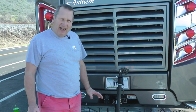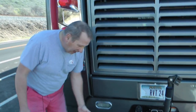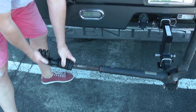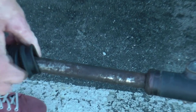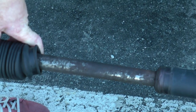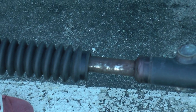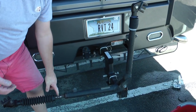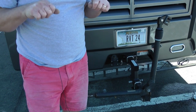This morning I thought I'd take these protectors off and see what's underneath. Sure enough it's very rusty - these really should be made of a material like stainless steel that doesn't go rusty. The problem is these are completely hollow underneath, so any rain goes in there and the shaft starts to deteriorate. If you leave it for a long period of time without using it, the rust is going to build up.